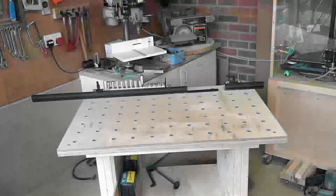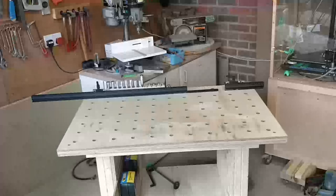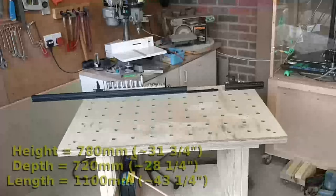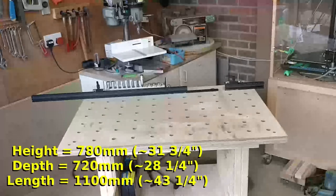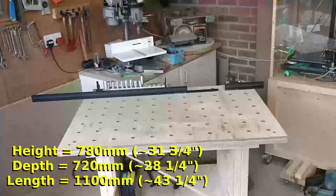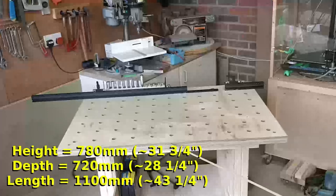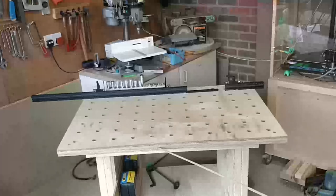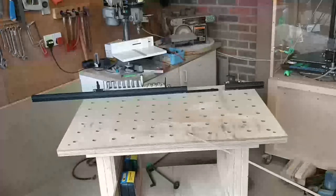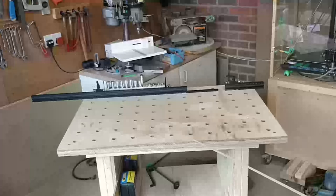This is a quick overview of my new bench. The frame is based on Steve Ramsey's basic mobile workbench, but it's been resized so it's the same height as my work surfaces over there and my workmate. It's also been resized to fit a standard MFT style tabletop, although I've doubled the thickness of it by putting another 18mm ply underneath. I then drilled out the holes so that I've got double thickness, because I want to use it more as a workbench than as an assembly table.